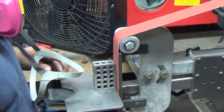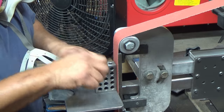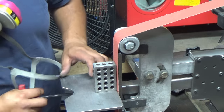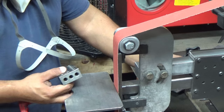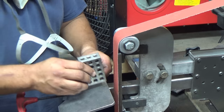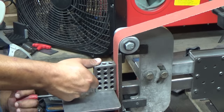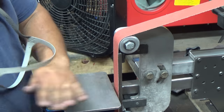I'm going to set up my flat platen and my work rest, but you want to make sure you're square at 90 degrees. So I've taken my 1-2-3 block — this is a very, very quick way to make sure you're aligned properly. I'm just going to loosen it up. As you can see, I can tilt it and bring it out just a little bit. So now to get the angle right, get my 1-2-3 block in there. There we go — holding it down with no wiggle. Tighten that guy up. Boom. Done. Now we've got a 90-degree work rest.